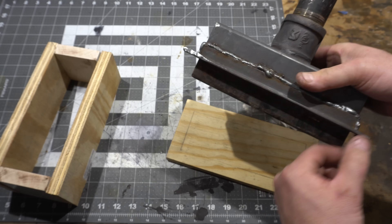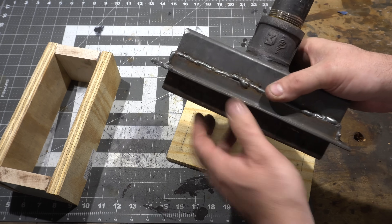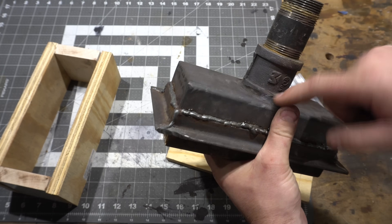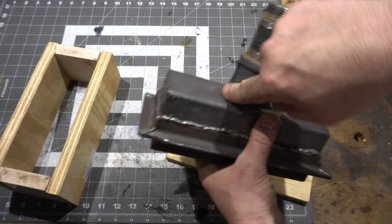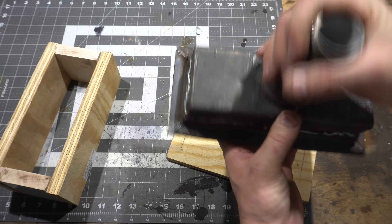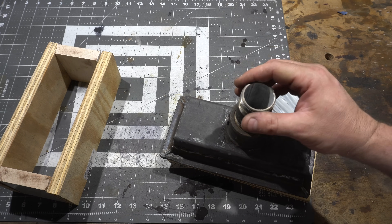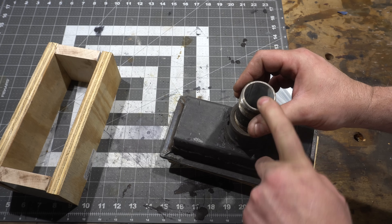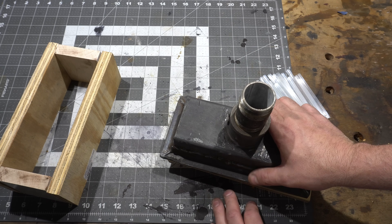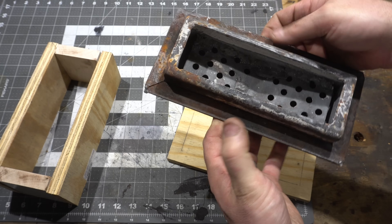That's really all there is to the burner. I put this flange on it just so it would sit on the forge level — I didn't want to mess with little thumb screws. There's just a coupling welded on top so you can screw in whatever size piping you want. I think this is one-and-a-quarter inch, but you can use two inch — you'll just need a bigger fan for a bigger orifice, and bigger burners need to deliver more gas.